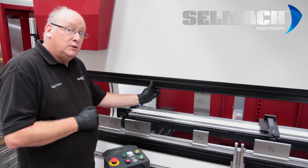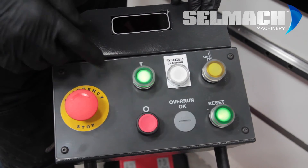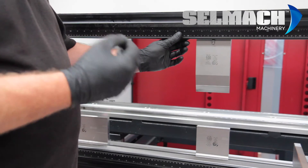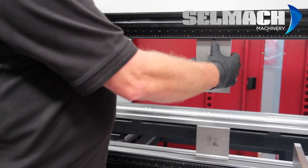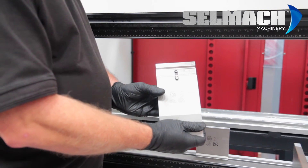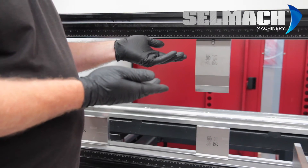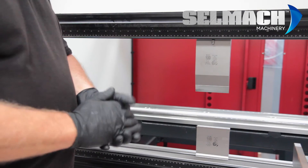Let me show how we change the tooling. To open the hydraulic system, you press the button here. Now you can see that the tool is loose and the hydraulic clamping is open. To remove the tool, you grab it with one hand, press the button with the other, and out comes the tool. To replace, put it back where it came from, place it up, and when it clamps it will automatically pull the tooling up.